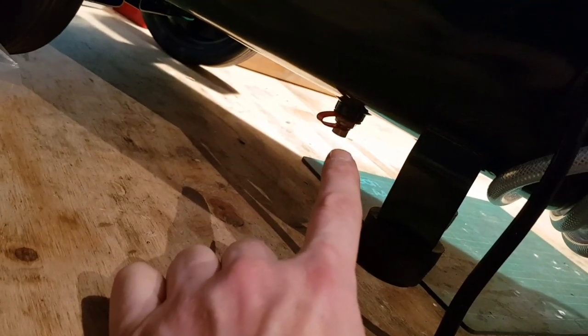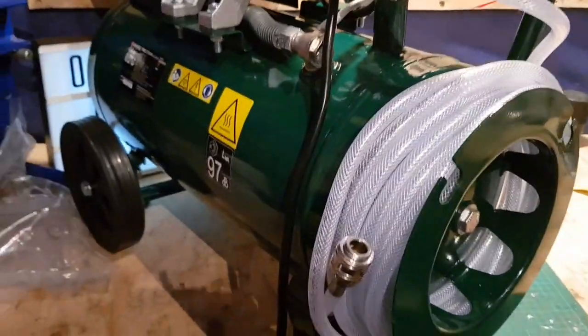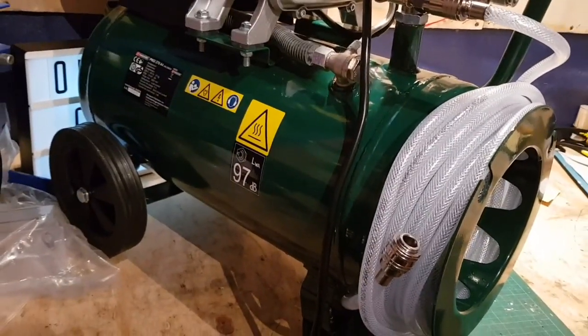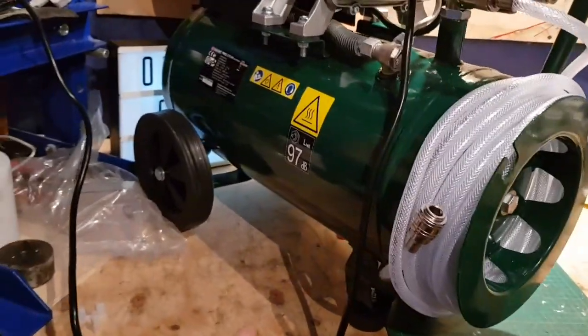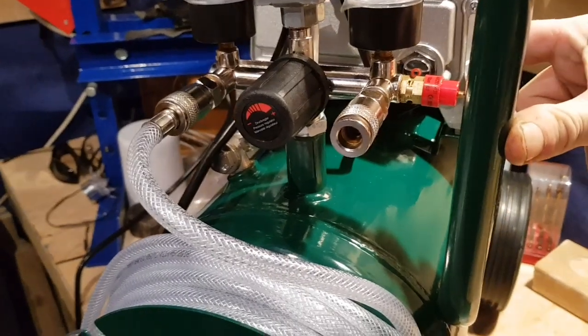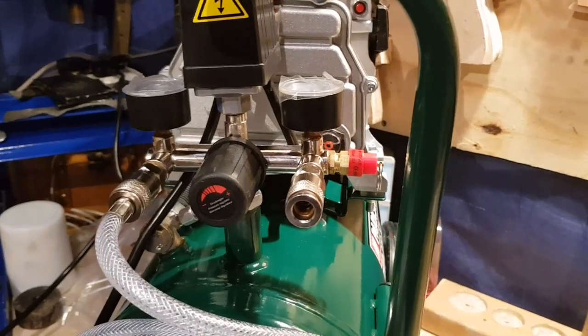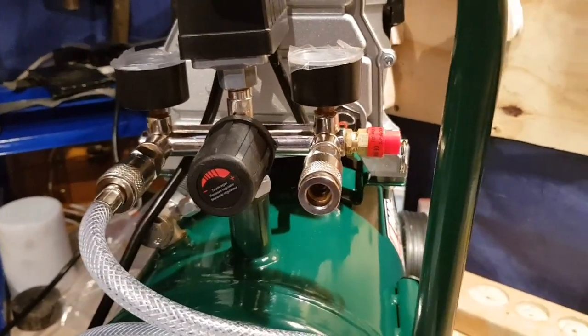I will say, always remember you do have a drain plug underneath. You don't want to go using it lots of times and not at least attempting to use this drain plug. There's a condensational buildup in the tank, and as you're trying to pressurize it, water won't compress — well, you've got an explosive device. So always be mindful of using your tap at the bottom. And of course, when the air's in it, you can pull this — and you can always make your kids behave, pretending there's a dragon out here. Excellent tip.